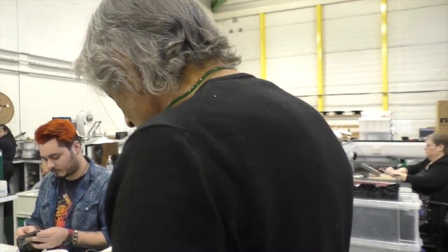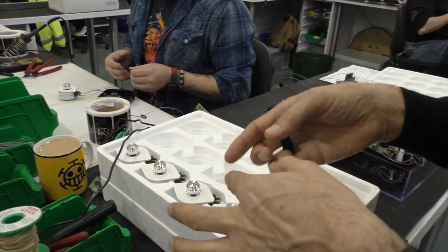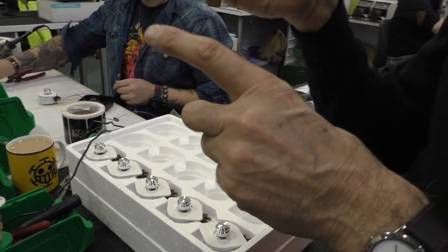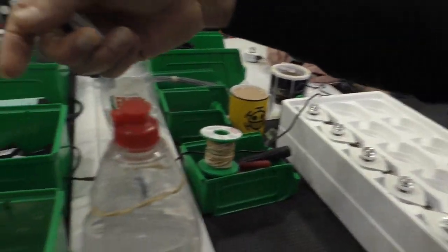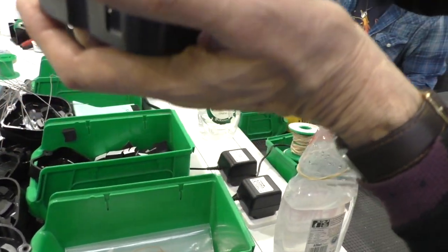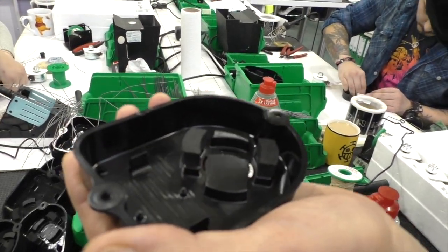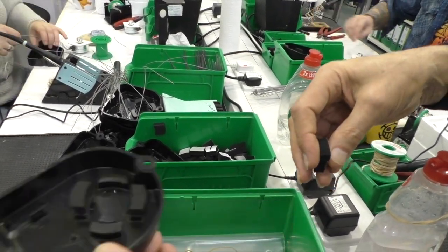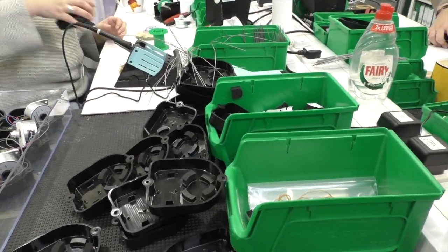So rigidly fixing means that whole area is glued on. But for reliability, if everything isn't perfect and it's 60 degrees in a shop window, the glue can maybe melt. So we also use these probes that push underneath and hold the motor in place. So it's a double rigid coupling, if you like. There's a glue joint and a force joint. And this is on which foot? This is a P1? That's a P1, yeah. So the P1 has gotten a lot more sophisticated over time. Oh, yeah.